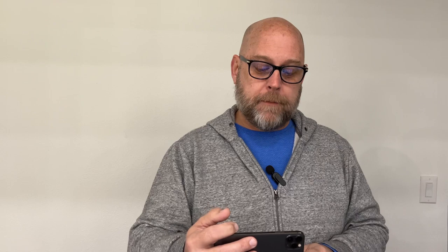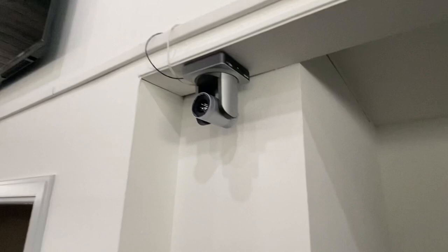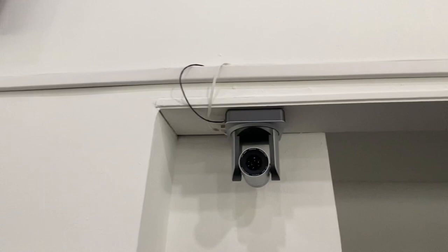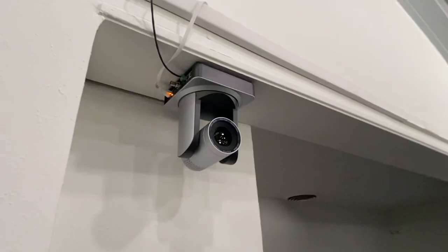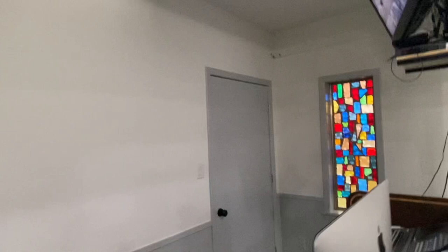We'll be running a two-camera setup. I have my Zowie PTZ camera here mounted at the back — that's an upside-down mount. I'm connected via PoE, it's running NDI wired into my router, and I have a PTZ joystick controller also run to the RS-485 connector on the back of this little camera. It's a 20x zoom, and it does great in low light. It gives me several different preset shots that I can choose, either from my joystick controller or through NDI Tools software here on the computer.